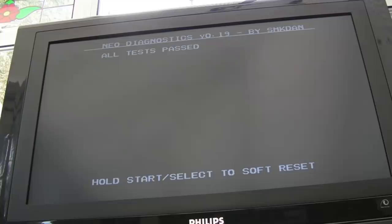So what I did there is I finally removed the GA11 one, the Neo-Buf, and put that in the Z80 spot. So it's like all these Neo-Bufs are faulty. It's like you swap one from one place, you think it's probably going to be alright, it isn't. There's more probability that it's going to be faulty in another location the same. And as you start taking them off spare boards, you don't know what state they're in, and they're actually faulty amongst these boards in the same sort of locations. I've had lots of palette problems, two or three lots of Z80 issues. So the problems are pretty bad on these boards, actually.